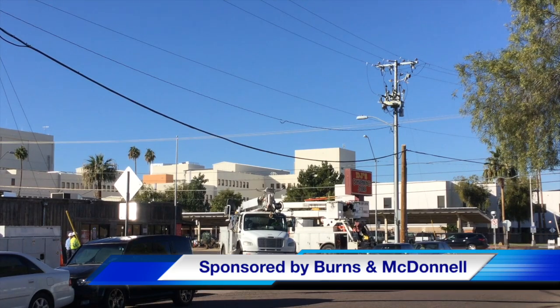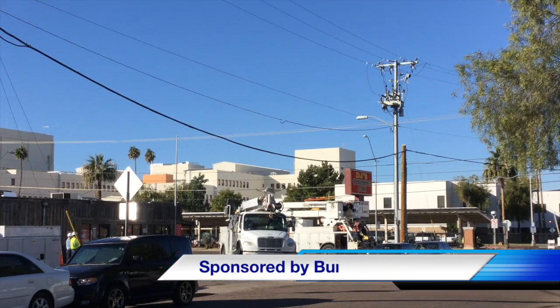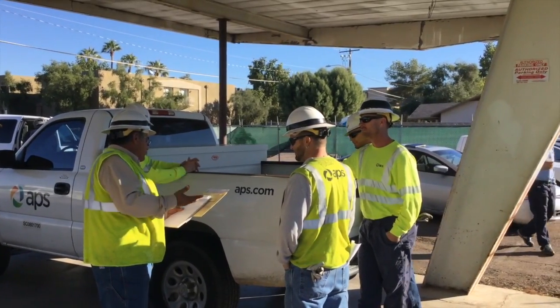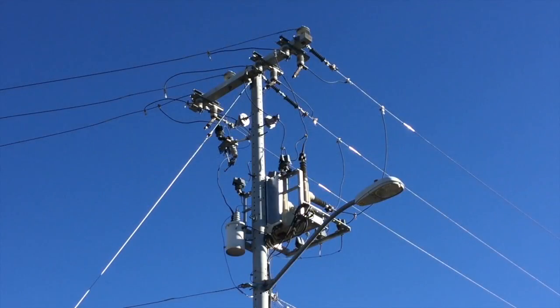The scene is a convenience store parking lot just outside of downtown Phoenix. We'll start with the pre-job brief and hazard analysis, and then we'll go up and look at the existing recloser on the pole. Reclosers provide feeder fault isolation, they segment distribution into smaller pieces to limit outages, and they allow communications with the operations center to speed recognition of a fault and response times.